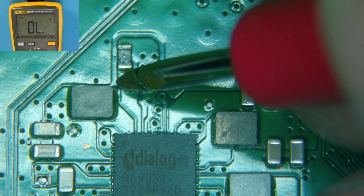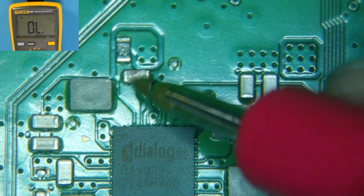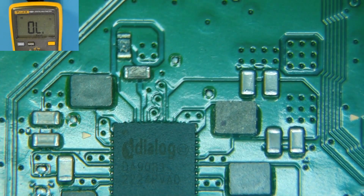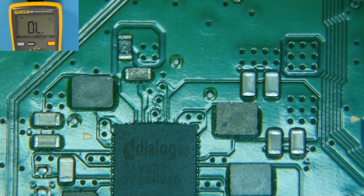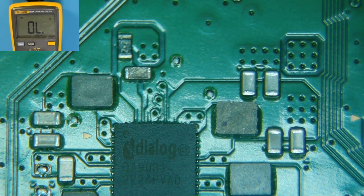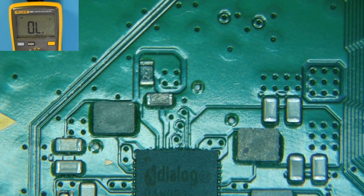Alright, so is it that cap? It does look a little funny, but some caps sometimes have a different color, so I'm not going to assume it's the problem. More importantly, this 5-volt line goes through a filter on the other side of the board, so we're going to have to pull the board either way. Let's take this cap off and see if that relieves the short. If it does, we still need to pull the board — I'll bet that filter is blown.